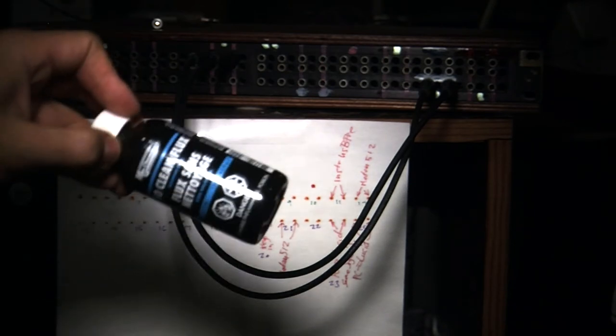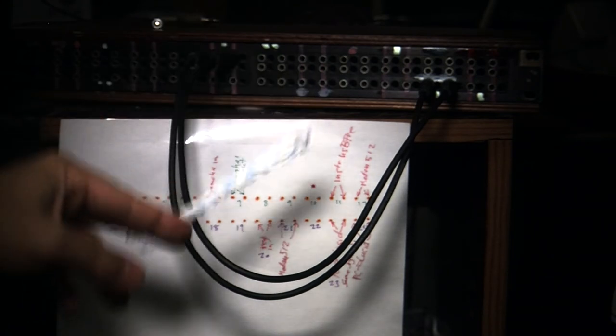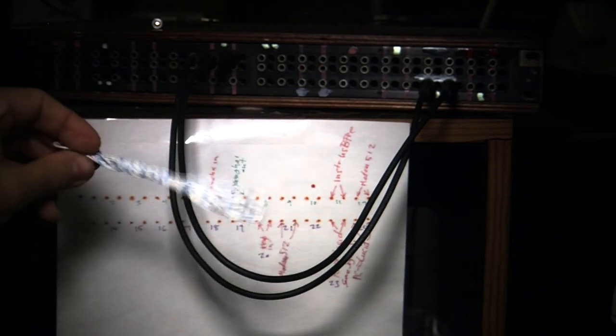The other thing you need to know about wiring is soldering. It's good to have flux paste — I use no-clean flux by MG Chemicals. If the solder isn't sticking, that's what I use. I also use Teflon-coated silver wire — it's got a very small layer of silver on it, which makes it easier to solder. This wire is fantastic for making little patches and connections inside your electronics.